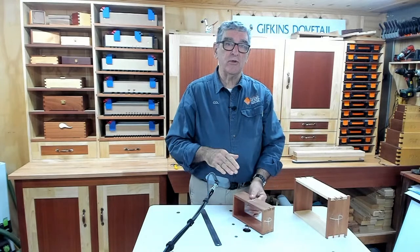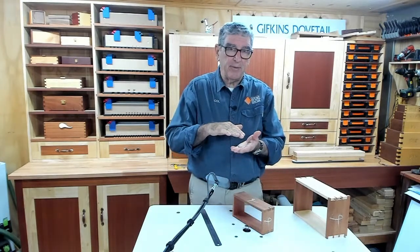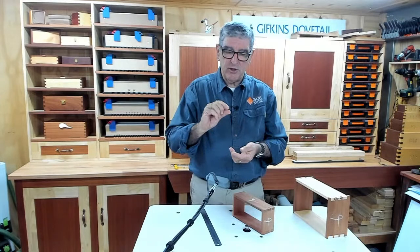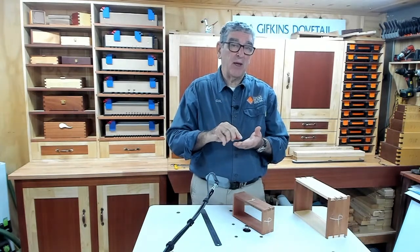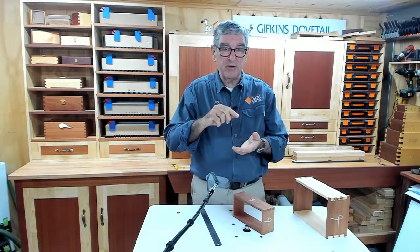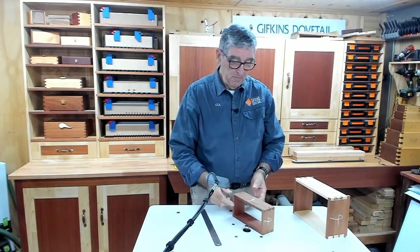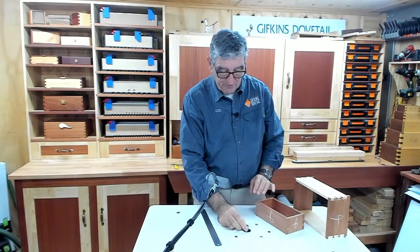If you wish to use thicker material, you can lift the router bit after your first cut. So do your first cut, then lift the router bit a little bit more and do a deeper cut, which means you can put a thicker piece of material in. If you want to come higher up and make it more than 10 millimetres underneath the bottom so that you can do a bit of fancy stuff on the bottom of the box, you can do that as well. You've got plenty of room to move with. Okay, so that's our first task.